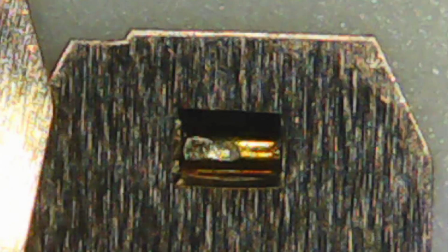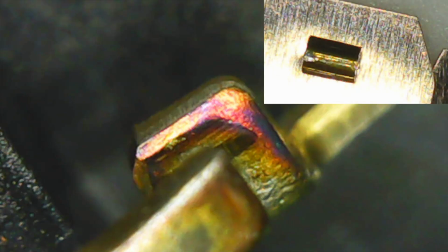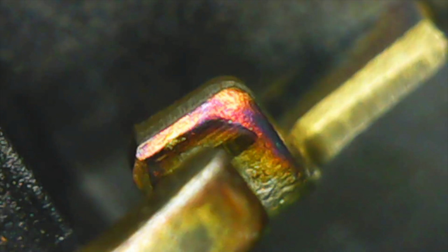And the problem that I have had in 100% of these switches is that eventually that contact deforms by clacking against this hard bottom plate. And then you start to lose conductivity, and the position shifts a little bit when you're pressing it. So you get the double click issue, and then you get the click and drag issue. To make that problem even worse, the clicker plate strikes off center slightly, so you are chattering to the left and the right as you apply pressure to that, just because it's not perfectly even and hitting in the middle. That's just like having a seesaw with one side drastically longer than the other one.